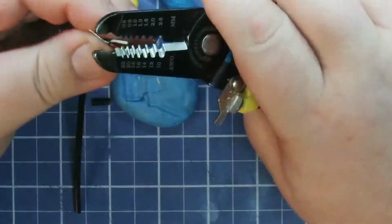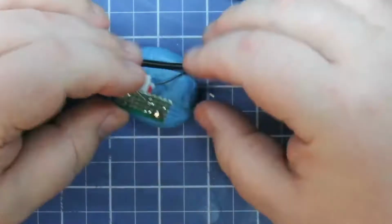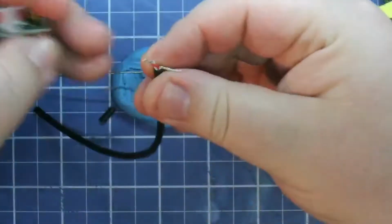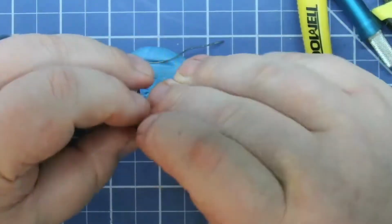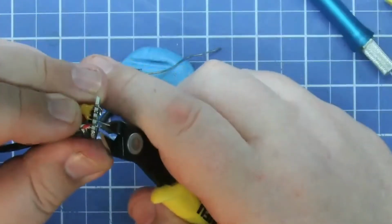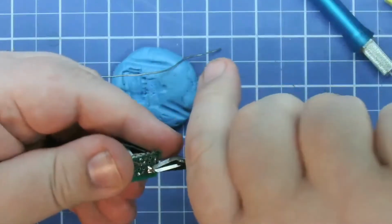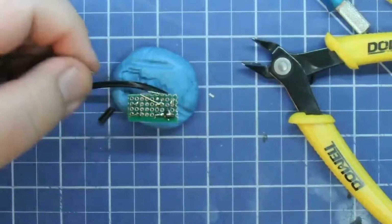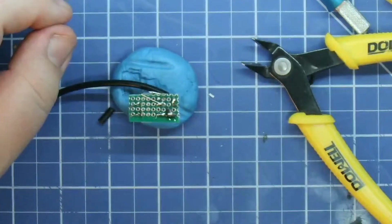And what I just did a second ago was put in another wire for the ground to come across. So if you look in the schematic, how this works is from the balanced side of the mixer, you have a positive and a negative, and then you have a ground. With that, you'll want to hit the positive and negative to the transformer, and then have the ground come across to the ground of the rig. You only want to do this once. So if you do a cable for going from the headphone out to the mixer, you do not want to connect that ground, or you make a ground loop. I found this out the hard way.